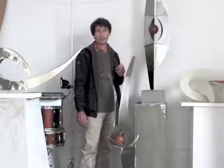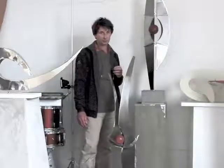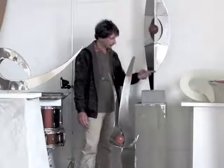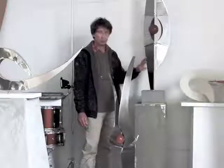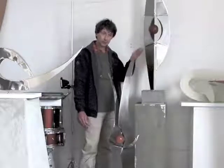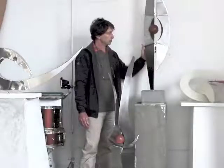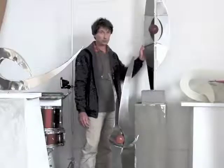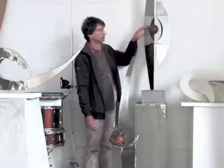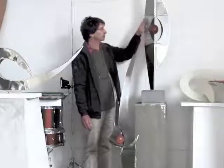Stainless steel is inherently a very dull material with a dull grain, and the challenge is to bring it to life. There are various methods to do this: you can mirror polish it — this is the bottom section of the sculpture — you can apply brush finishes, you can vary the grain of the brush, you can vary the direction. You can also place other pieces on the surface to give it more relief. This middle section I've scored the surface where I've taken the grinder and actually cut into the metal, and then sanded that off, and it's given it an interesting texture.